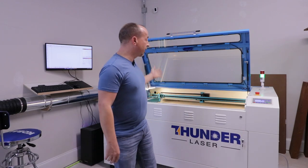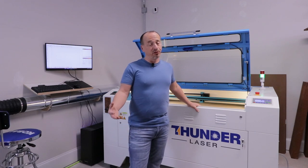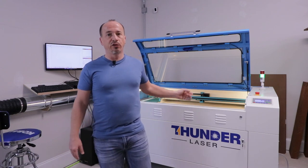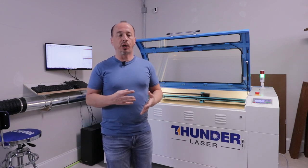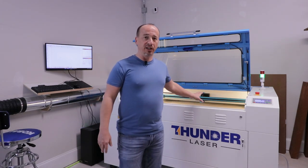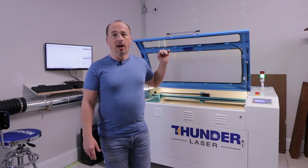One of the number one reasons I went with this company for its price point is that their machines use hybrid stepper-servos — kind of a happy medium. In the CNC and laser world, all the high-end stuff uses full servos. Hybrids are that halfway point, so you get faster travel speeds. This machine with the included two-inch lens can do up to 500 dots per inch.